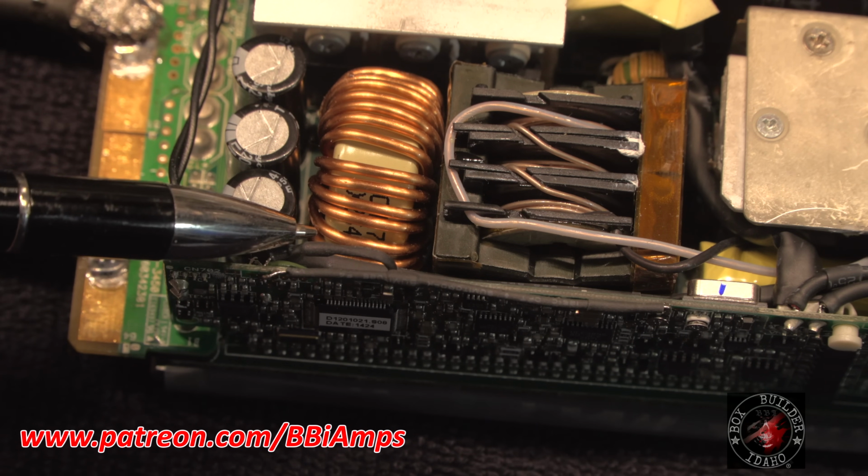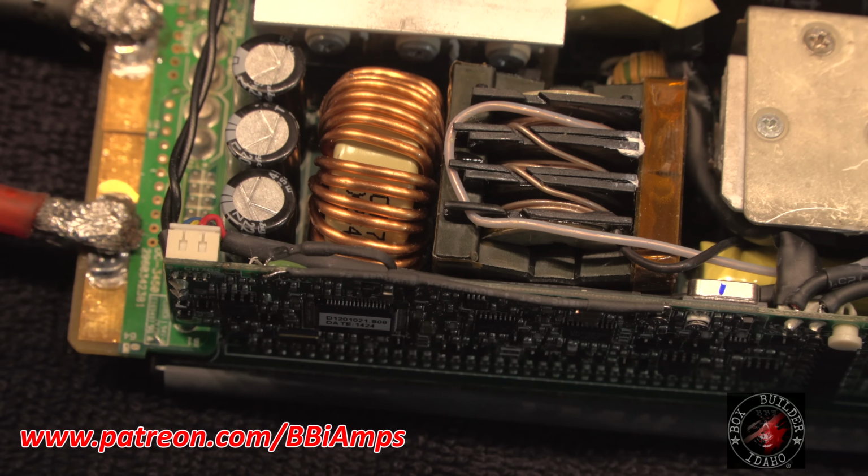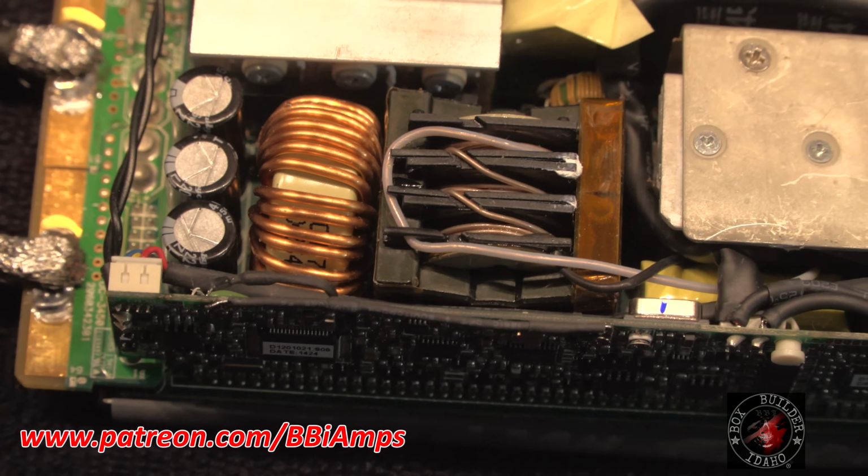So if you think about it, 51 to 18K. I've tried it every other way. Every other resistor combo from 51, I think in the notes the guy actually said 58. From 51, and had to slowly walk it down, and 18K is where I ended up. That's what I did.